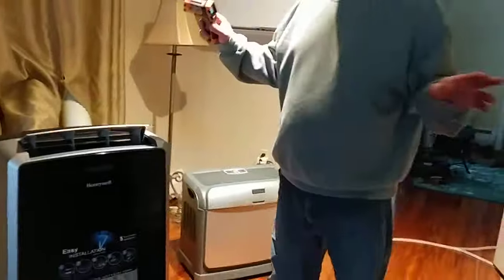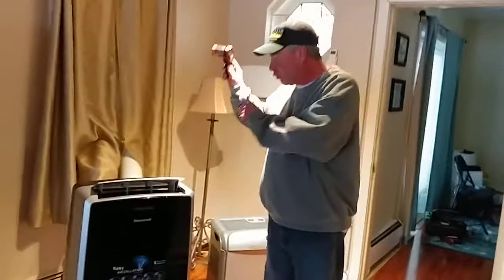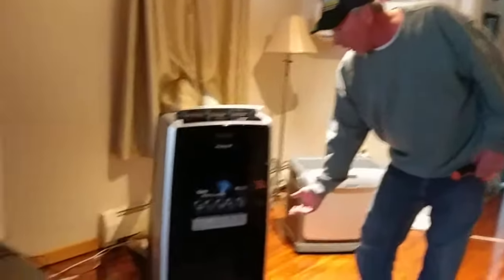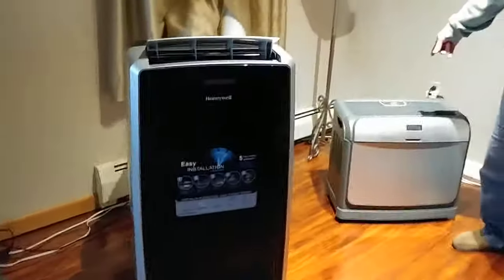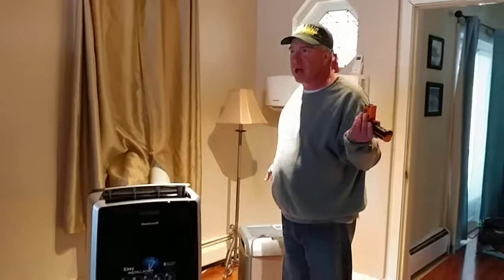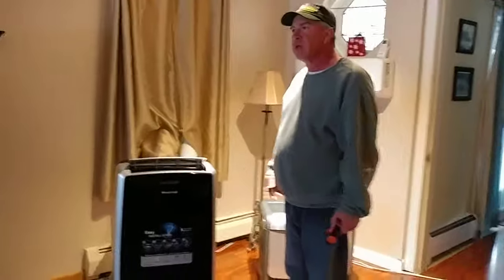My point is, YouTubers, if you do get a dual hose unit — four-in-one — you might want to elevate it like I did here. I've got a furniture dolly. I elevated it because it does drain condensate, and there's just a little Tupperware pan underneath — empty it once a day. A humidifier over here is pretty much needed too, because it does dry it out a little bit. Our space up here is probably maybe 1,600 square feet upstairs.